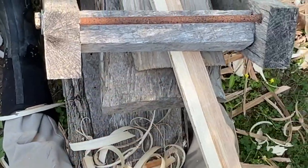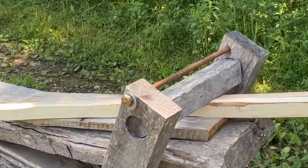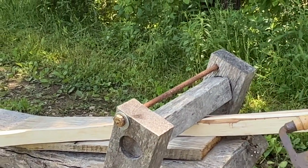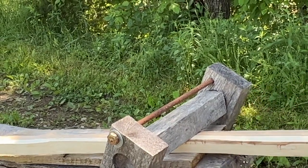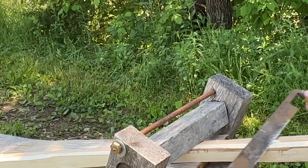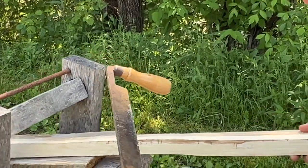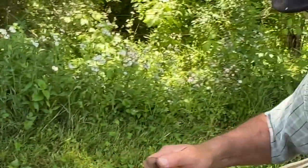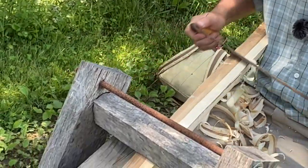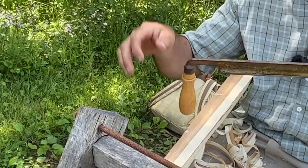Like I told you, I need to make some hay fork handles, and I would do them basically the same way. Work them to square, and then you knock your corners off and turn your square into an octagon, and then you take your octagon and you work those angles off, and you just keep working to the round.